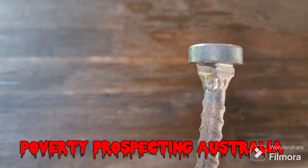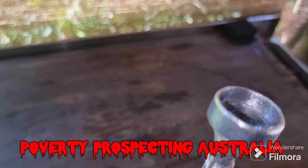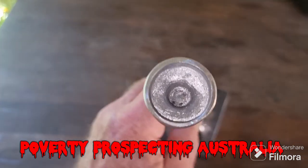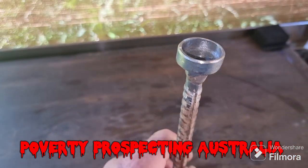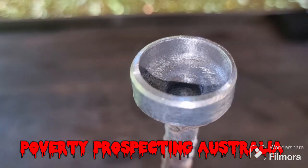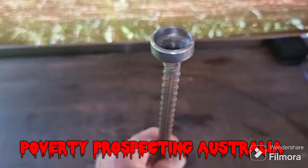Now gal is not good, which I found out. I did clean off the thread, I cleaned out most of the gal — I thought I'd got all the gal out of the center of it with a die grinder, and I scrubbed it, cleaned it, heated it. Once it was glowing red you could see the little pockets in the side that had tiny little bits of gal still attached to it.